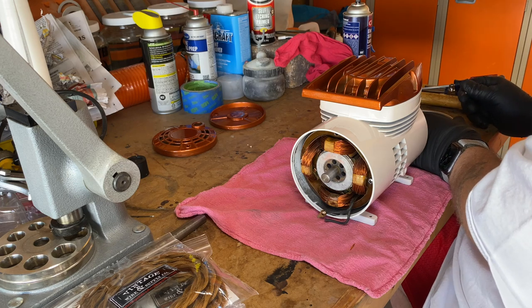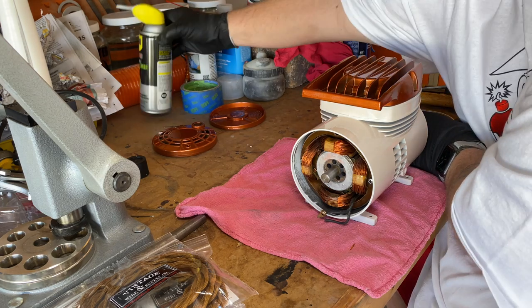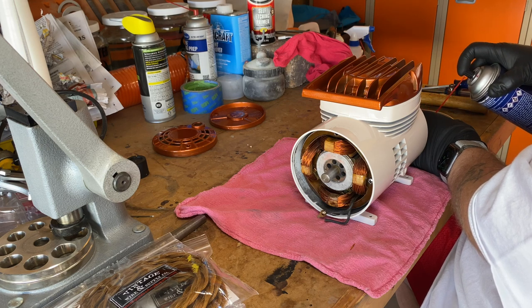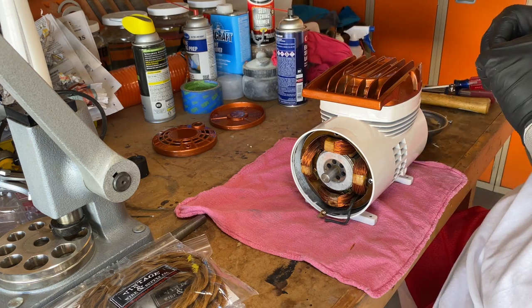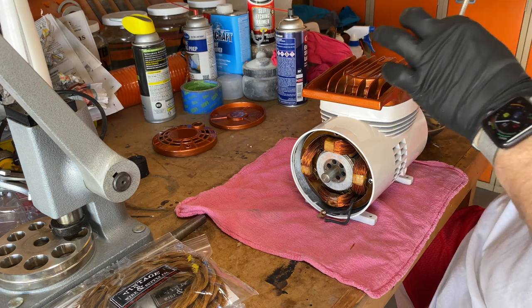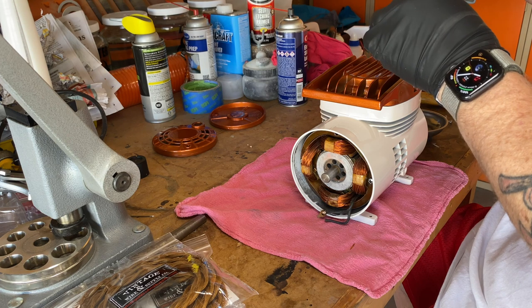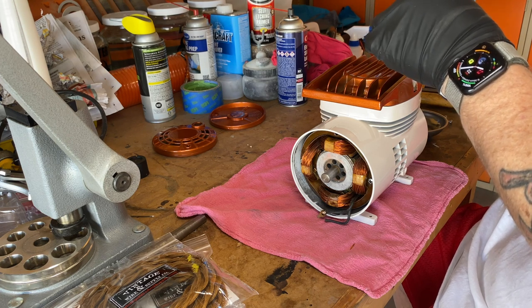Next, I'll screw the head back on. I make sure to tighten this down very tightly, and I also tighten the screws using a star pattern to make sure that it goes down evenly. Once I'm done with this, I can go ahead and turn my attention to the end caps and the power cord.